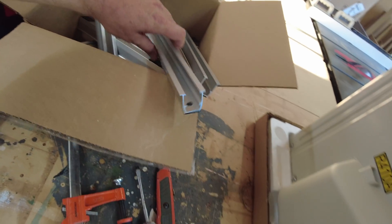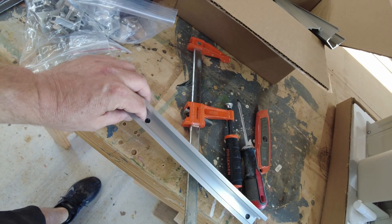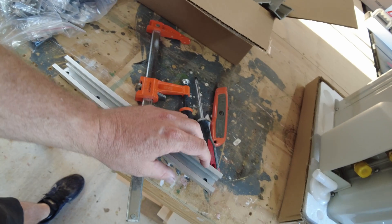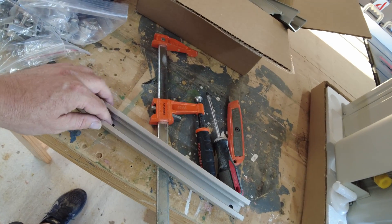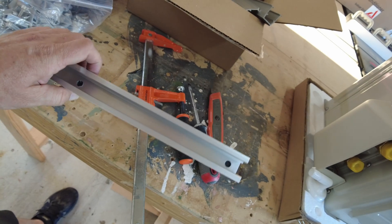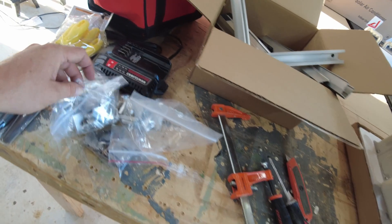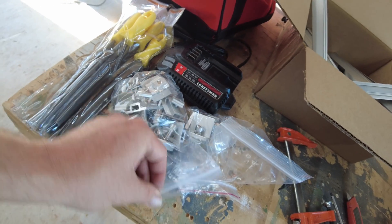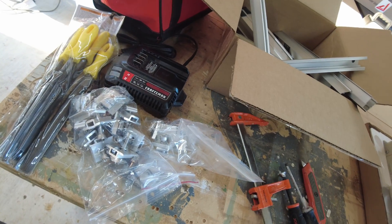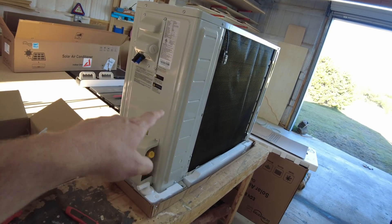We should be able to get all seven of them up in portrait mode - straight up and down. What we're using to mount them on the roof are these mini rails - they just literally screw to the raised section of the corrugated metal roof and seal right there. In between the panels we have mid clamps, and then we have our end clamps. Here's the outside unit.